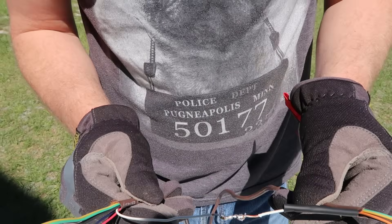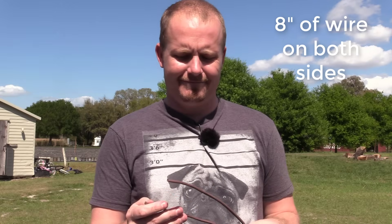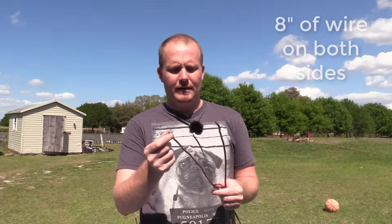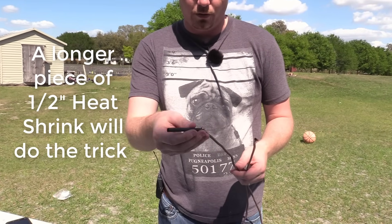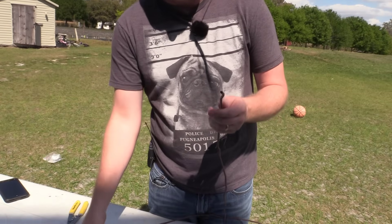You want to put this in your mouth immediately to cool it — just kidding, don't do that because it will hurt your mouth. Let's talk about some lengths: you need at least about six, probably more like eight inches for this to be a practical splice, because you have the actual splice itself but then you have to run heat shrink down the wires. Take a piece of quarter-inch heat shrink and run it down the wire, and then run a piece of three-eighths over top of that, running it well down the wire and out of the way — do that on both sides.